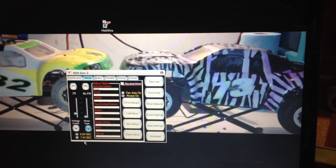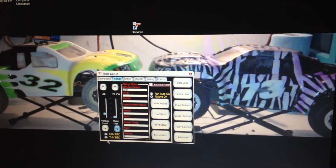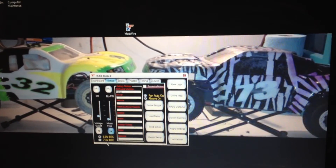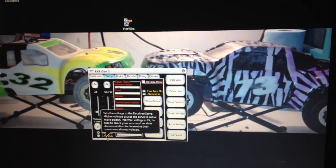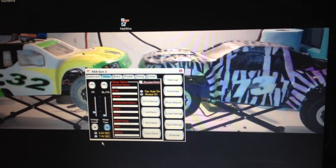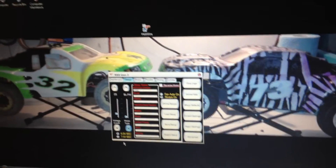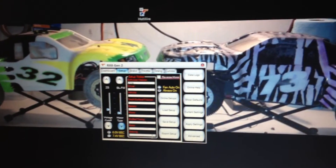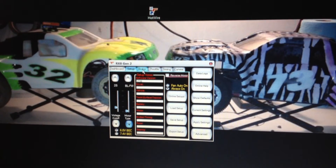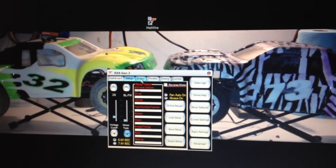Down here, you have to use the Hotwire — you cannot use onboard tuning to switch your BEC from 6.0 volts to 7.4 volts. Anybody running a Spektrum receiver, you are good up to 9.6 volts; however, you want to check to make sure your servo can handle the same voltage, as it is going to get its power draw from the speed controller. I emailed Savöx and I'm waiting to hear back to see if I'm good to go, as my spec sheet only shows up to 6.0 volts.